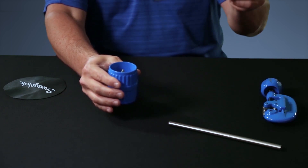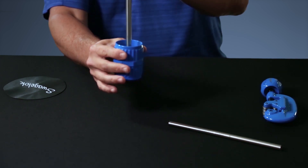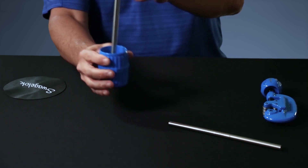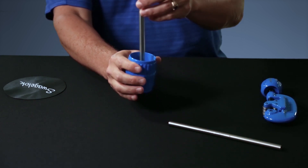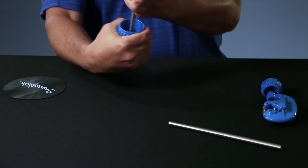In order to do so, you're going to want to take that piece of tubing and insert it into the tool from above. We want to capture the shavings of the burrs inside the tool — we don't want those shavings going into the ID of the tubing, as that could create some problems with your system down the line.